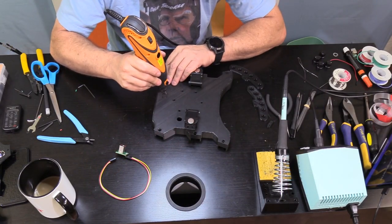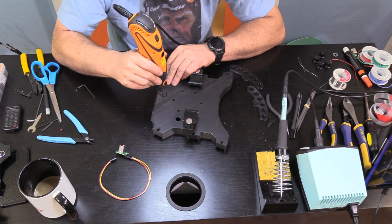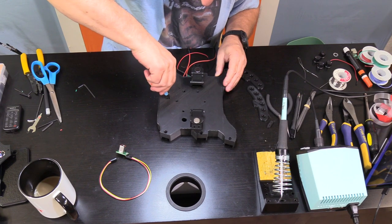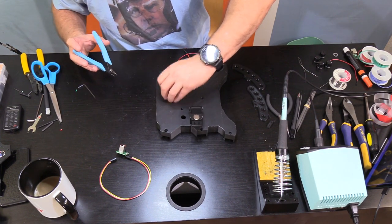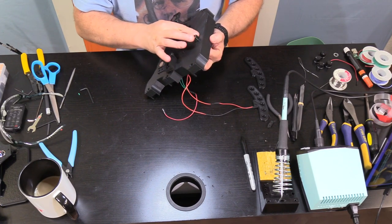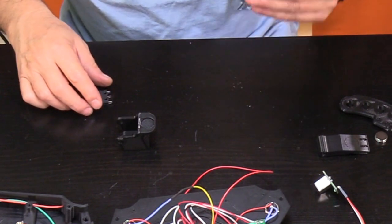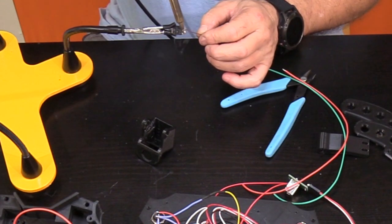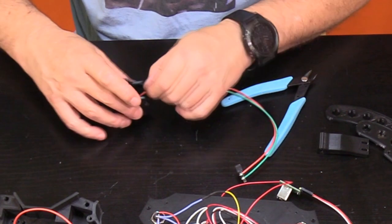This finishes the front and we can now move on to the back part of the wheel. The back part will only hold the dongle or USB connector. The original design used a different design than I'm using, so I had to cut away a hole and glue that into place. Because the main board is on the front, the wire from the connector needs to reach the board from the back plate of the wheel. That takes us to the shifters, which are also mounted to the back plate - their wires will also need to reach the front plate.